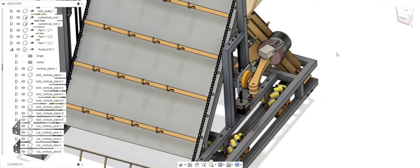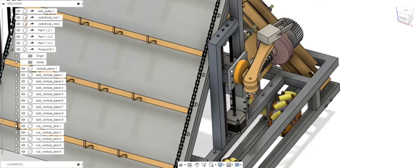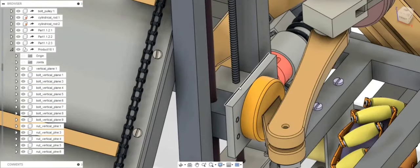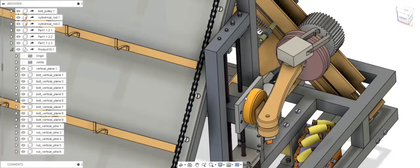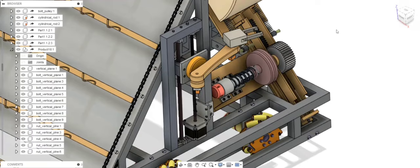For that purpose, an arm-like structure has been designed. To reach the handle, we first have to control the height that the gripper needs to reach in order to be in the same plane as the handle. A screw joint has been made with a link, and a threaded shaft can be rotated with the help of a motor, allowing us to move this link upward and downward.